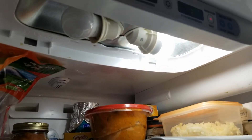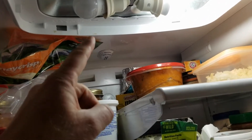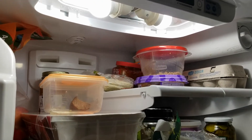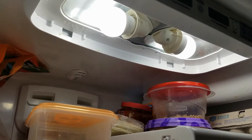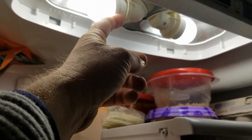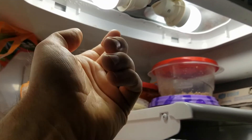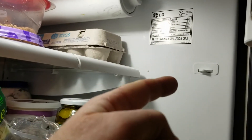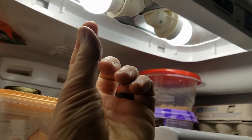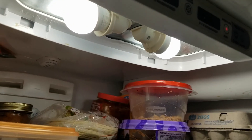As you can see, only one side is illuminating. That's some great light, but I'm really curious as to why this side is not coming on. After a little bit of troubleshooting, we discovered the problem with the bulb that wasn't immediately turning on — one of the connectors inside had kind of mushroomed down. We had to take a little pick and, with the power turned off, get inside there and make sure that connector had pushed back out and was making good contact with the bottom of the light bulb. Now it seems to be working great.